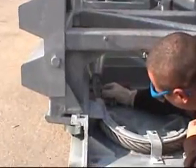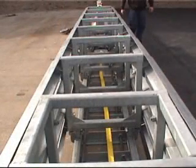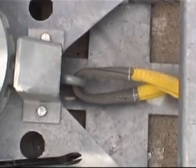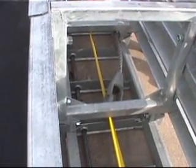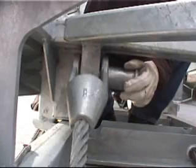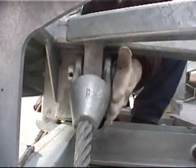After the cable is moving freely, you should inspect the cable for any damage. You should read the installation manual for exact procedures on determining whether the rope will pass this inspection. Next, run a chain or strap under the sled back to the front mobile sheave assembly and attach it to the pin shackle supplied with the front mobile sheaves. Pull out the mobile sheaves, making sure that the spelter socket is traveling freely back to the front sled. Take your time on this procedure, as you may have to guide the spelter socket over the support gussets. When the spelter socket gets close to the front sled, reattach it to the sled, because the cable may be too tight if you perform this procedure last.